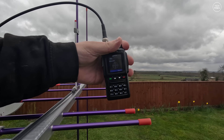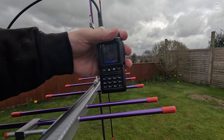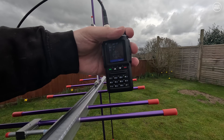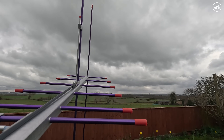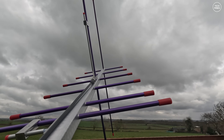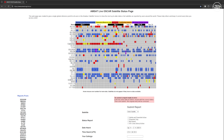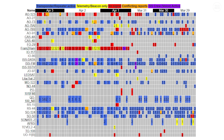My first test with this antenna was on a rather miserable day here in the UK. I was using the GD-168, which has the satellite tracking feature. The prediction on the radio showed that AO-27 was about to come into view with a nice high elevation over my location. However, after 10 minutes the pass had ended and I hadn't even heard AO-27, let alone talked through it. Going back inside and checking online, AO-27 appears to be pretty much dead. I'd recommend anyone looking to get into LEO satellite work to check the AMSAT status web page to see which satellites are currently active.